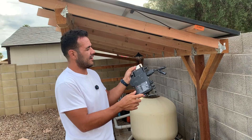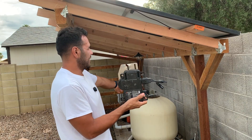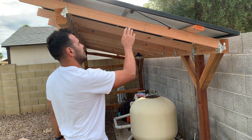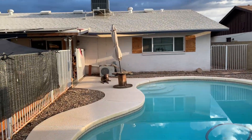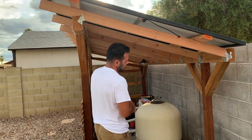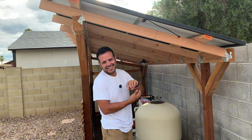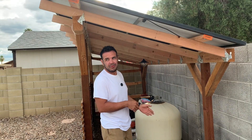I'm not going to be grid-tying, but I've seen people use these in an off-grid type of setup. I'm going to do some experimenting with these microinverters, primarily to see if I can offset the pool pump every time it kicks on. Right now these five Canadian Solar panels are wired in series and connected to my mini split, which is powered almost all day by those five panels. I don't need five for the mini split — probably only three — so later I might rewire it so three power the mini split and two help offset the pool pump.